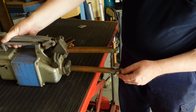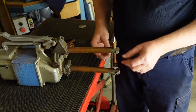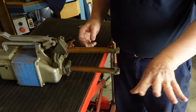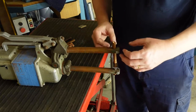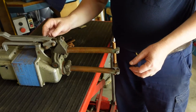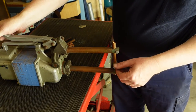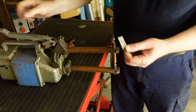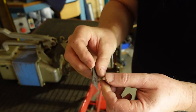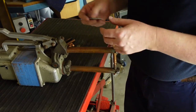You put your material in there and clamp it — clamping pressure is important for reasons I'll explain. You apply some current and everything's wonderful. If you see sparks coming out, you're doing it wrong, because that's molten metal escaping. You should always be wearing safety glasses for something like this. Then it's just a matter of pulling the trigger — it can get quite hot — and there you have a spot weld. Pretty much any metal can be spot welded; it relies on the surface resistance of the metal.